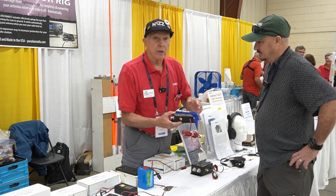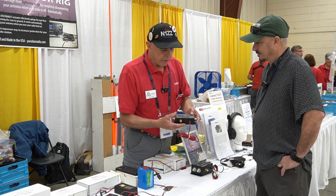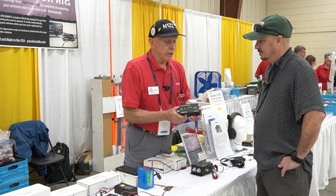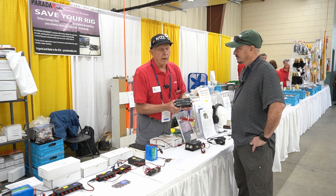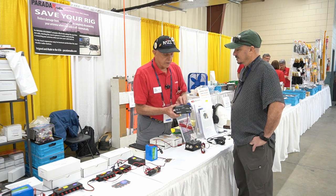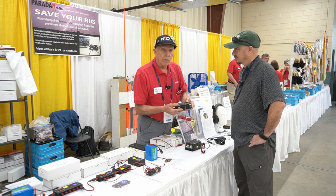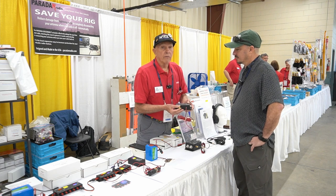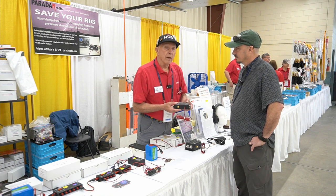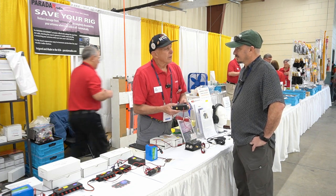We do have another one that has additional stuff on it — I'll explain that in a minute. This is a pretty robust device. There are two 15-amp contact relays in here, which means you can use this at well over a kilowatt with a high SWR antenna. It's in a waterproof, solid metal case, and this works out to 54 megahertz. It's made to work very well for all radio sets, including all the remote stations. They really like it because they can turn their radios off and their antennas are disconnected and grounded automatically — so that's a great advantage.